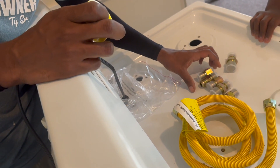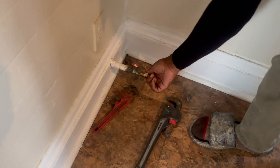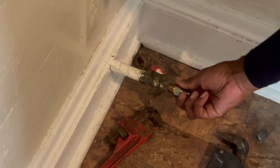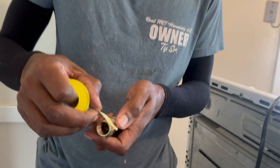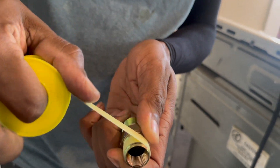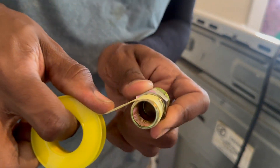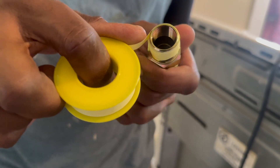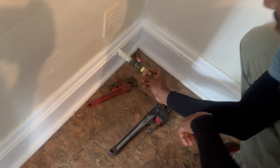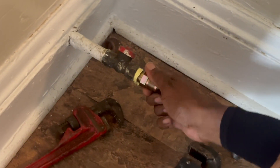Tape and connector — we're gonna roll with that right there. See that, that's going to twist in like that, and then the gas line is going to connect to here. But before we do that we're going to grab our tape and wrap this clockwise. We're going to wrap it at least three times, but being standard we're going to do like four. Then we're just going to screw this inside here.